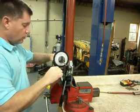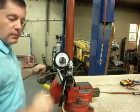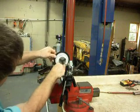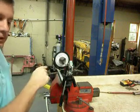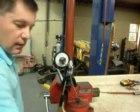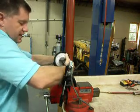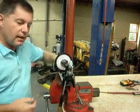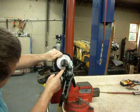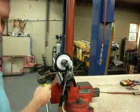Come out one and a quarter inches to 17 and a half. Rotate to 260 degrees — come around to 260 degrees right here. Then bend with confidence to 45 degrees. Now move out three inches — from 17 and a half that's 20 and a half — and rotate around to 150 degrees on the face. Lock it down with the thumb screw and bend at 45 degrees.